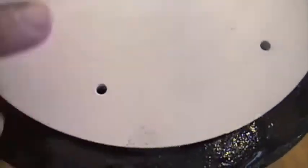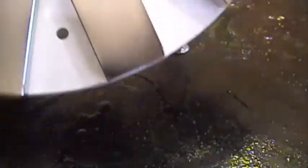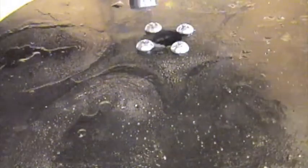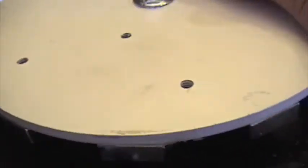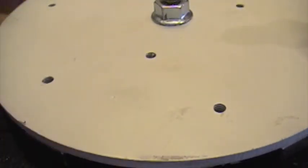Up here is the top plate — this is where we're going to attach the rotor arms for the blades. Quarter-20 bolts pick up on this rotor plate, pretty easy to service if you ever need to. This just pulls out — that's the magnet plate with the three-eighth inch magnets. Just a little bit of oil in this hub should go a long, long time because it's got nowhere to go. It's pretty much shielded from the elements since the rotor arms are quite a ways out, and it just free spins.